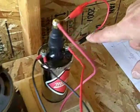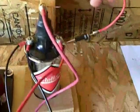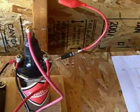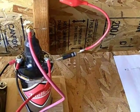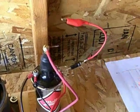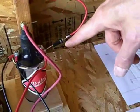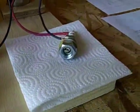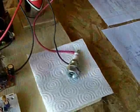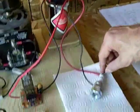I have our blocking diode here, which is on a little thing so I can disconnect it or connect it. And this is a 12,000 volt diode from a microwave oven power supply, and it can handle 30 amp pulses, but in general it doesn't like that all the time, but it's good for a reverse voltage up to 12,000 volts. And then the output is our spark plug over here. The low voltage comes back to the negative, which is the case. The output, this is a special wire that has 20,000 volt insulation. It's a little different than the others. Goes right to the top.